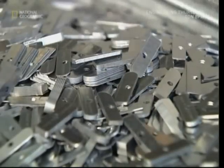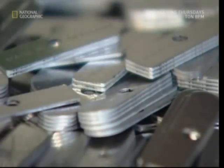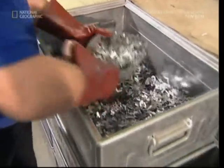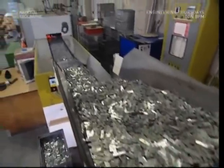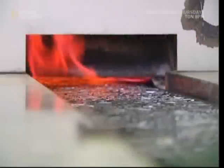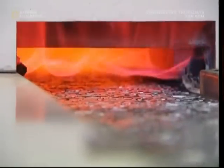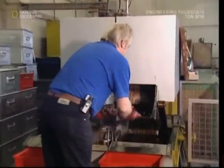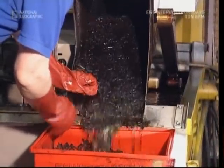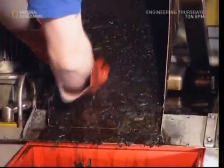In order to punch them out, the press uses oil to lubricate the process, so the fresh blades are all stuck together and will need a good bath to rinse away the excess oil. They're then heading for the ovens, where they will be superheated to 850 degrees Celsius for 3 minutes. When they emerge, they're cooled with another oil bath, and the rapid cooling is what hardens the metal.